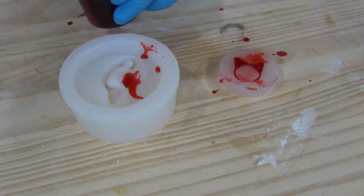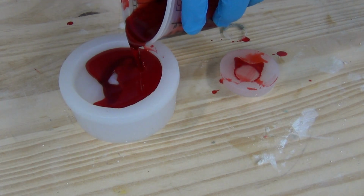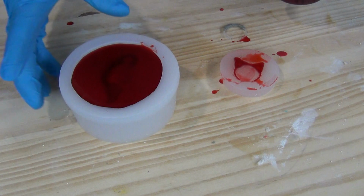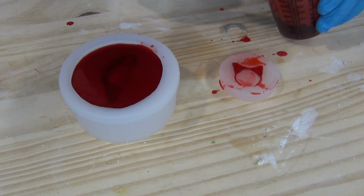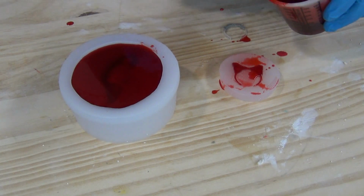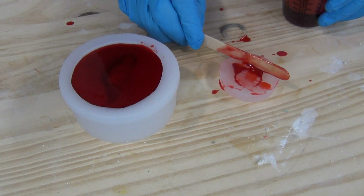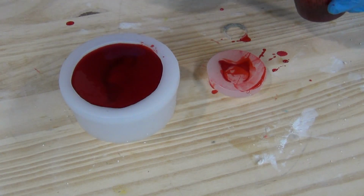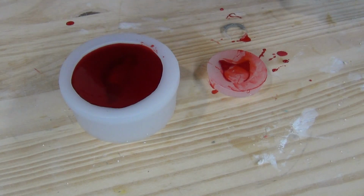So there's our happy little ears for Rourke. And then we'll use the rest of that resin to fill up that ear. These are just little ear samples that I pour up for our customers that need cured samples. So I'm just going to add a little bit more to that. And then again, just scrape that off. And that's why I chose this configuration, so we'd have access to all of that and be able to easily scrape away and sand any extra material.